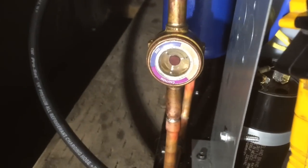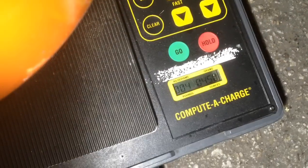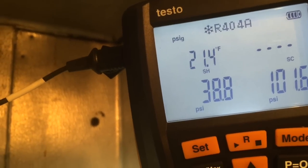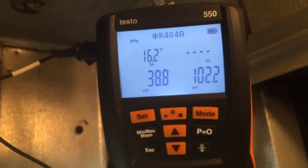I'm at 5 amps — I need to add some gas still. My total charge came out to 4 pounds 4 ounces. Okay, so I'm in the cooler. The coil looks clean — you can see my flashlight through there. This one has Danfoss valves. I'm taking the cap off. My superheat's looking like 21.5 — that's too much. Let me get to adjusting this; let's see if I can get it around 12. I might have turned it too much but we can play with that.